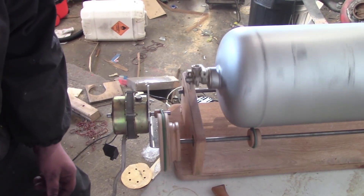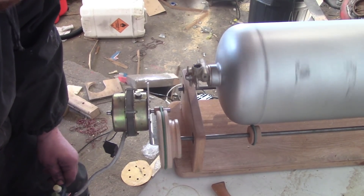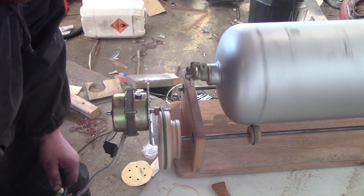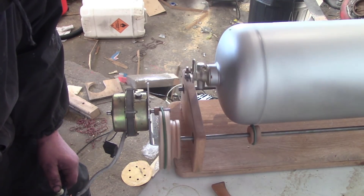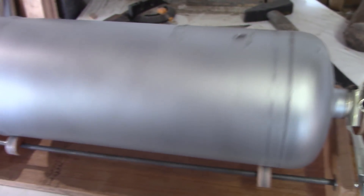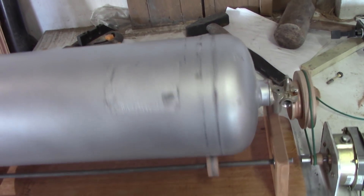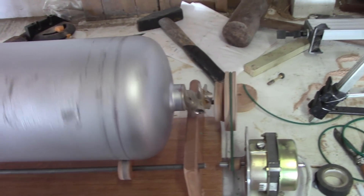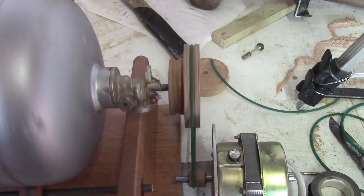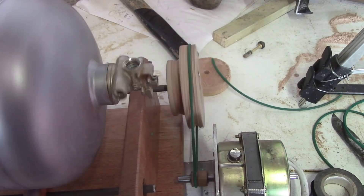Bigger pulley on it. Speed of the cylinder is reduced. It's still not working on the lower speeds though — unfortunate, but I think you might have to just live with this. Here it is doing exactly what it is supposed to do. That pulley is wonky, but despite the fact that the pulley is so wonky, the belt is remarkably straight. More luck than by design, I suppose.